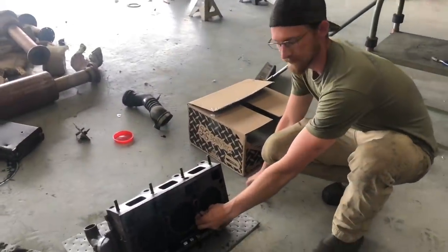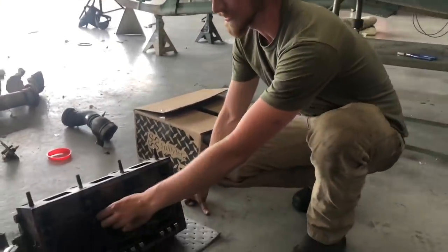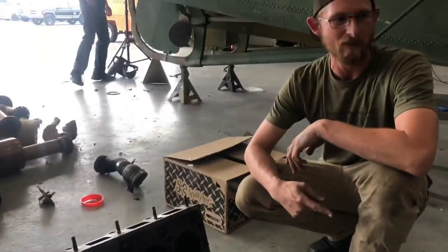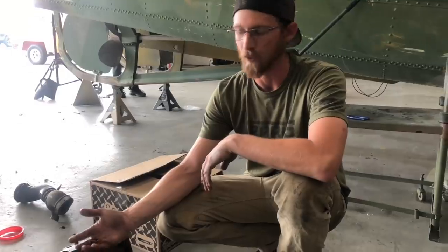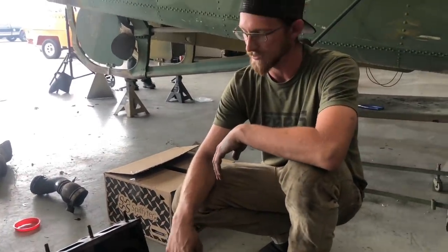So we've got Detroit Professional on the come up over here, Andrew — coming up as the youngest Detroit genius in the world. We just pulled the head off of this guy. We're going to do new o-rings and everything, just to make sure we're not leaking any oil. Now that we're turbo-ing them, we don't want to lose our boost around the o-rings, so throw new o-rings in there.